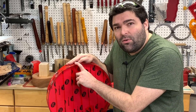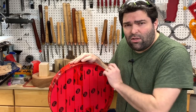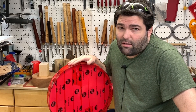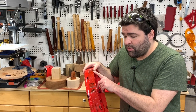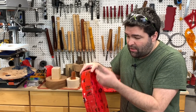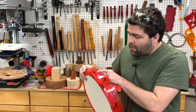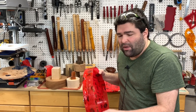That means if you don't want to use plexiglass — even though it's nice and flexible and molds to the shape very well — you could use a thin piece of metal, cover it with tuck tape, and it'll probably do the same thing. If you used a flexible metal strip you might get away with just one seam, which would be a little better. I didn't have that in my shop, so I ended up with three different seams. If you did use metal, you also wouldn't need the metal band around the outside to stabilize the seams.